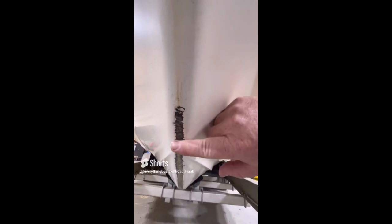For today's find, we're inspecting the hull of this mid-sized powerboat. Everything looks pretty good, but as we crawl under, we can see keel damage — damage to the fiberglass, and it's pretty deep. How did this happen? The trailer is not adjusted properly, and the owner has been rubbing up on the trailer frame when loading and unloading the boat.